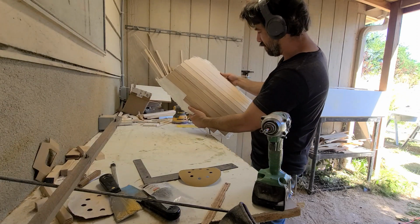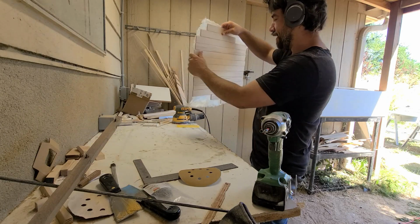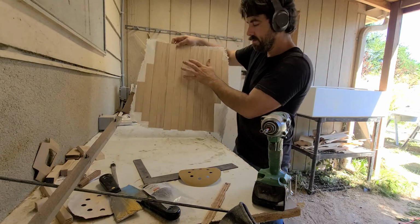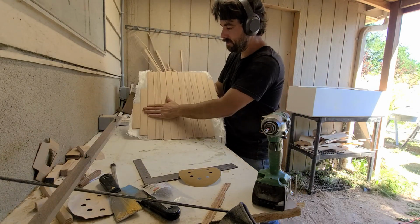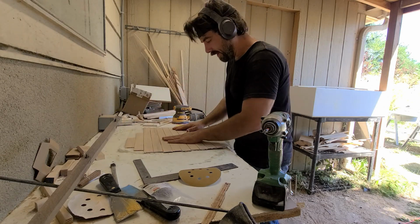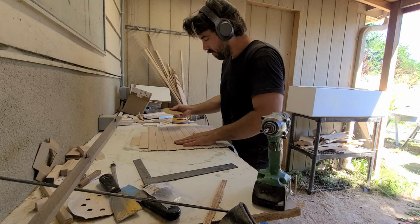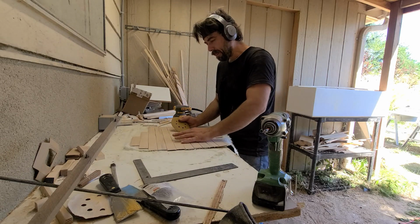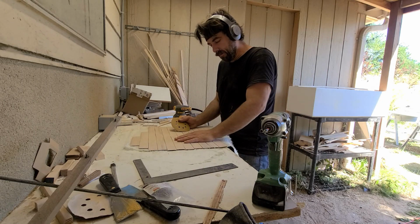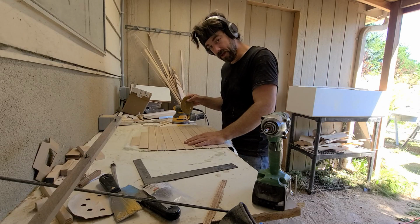I mean, you could technically make like a waterproof barrel, but this technique in this direction doesn't flex nearly as much, but it gives us enough that we should be able to get whatever contour we need out of it. So my next step is to hand sand this with a lighter sandpaper. Then we'll probably cut them to size before staining and finishing them, and then we'll just install them somehow. That's a problem for a different day.